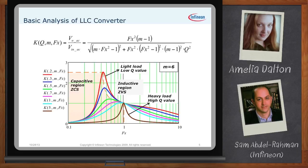Each of those curves represents a load value, or in other words, a Q value. The red curve is a light load condition; as I go to lower curves, the output load gets heavier or higher in current. One concern is that each load has its own peak value. To the right of the peak is the inductive operation region; to the left is the capacitive operation region. One design condition is that I must always stay in the inductive region — the capacitive region, shown shaded, is prohibited.